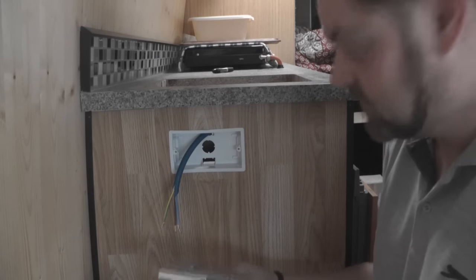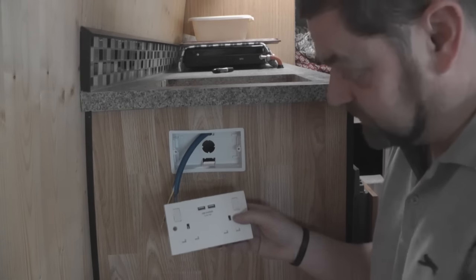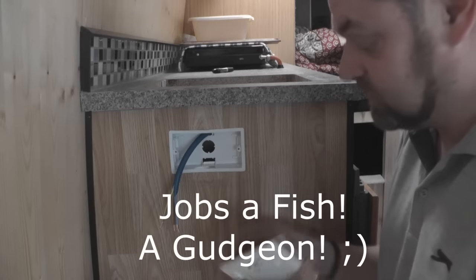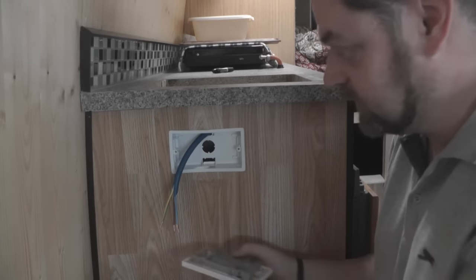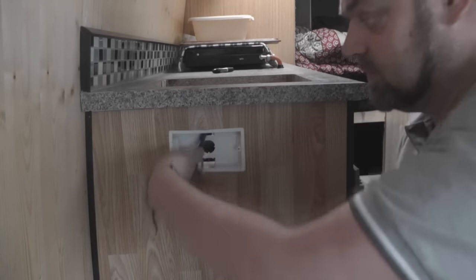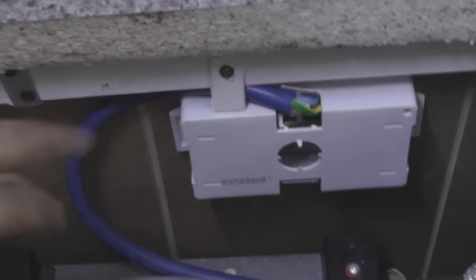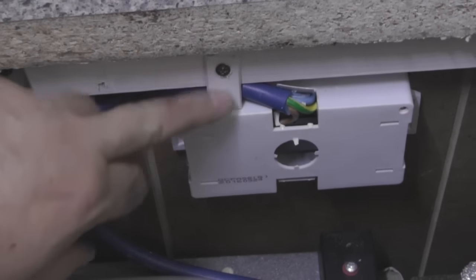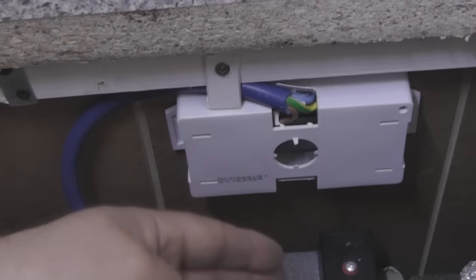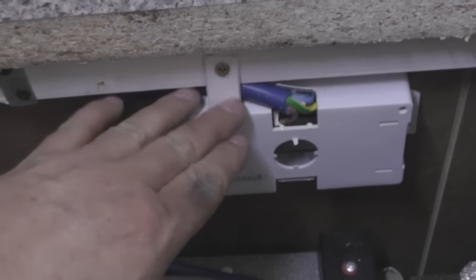It is just like wiring a plug — follow the colour coding, it's monkey see monkey do. Earth, neutral, live — connect those and it's just the same as doing a plug. All you do then is fit it in, screw it in, and that's it — job's a fish. I'm going to feed the wire back, secure the socket, and I've put a small blanking plate here to keep the cable tucked in so it's not going to fall forward and get caught on anything — it tucks it neatly out of the way.